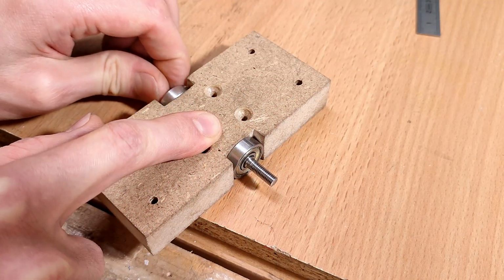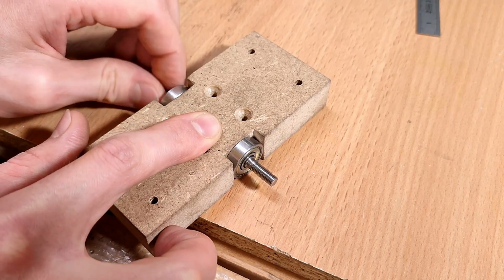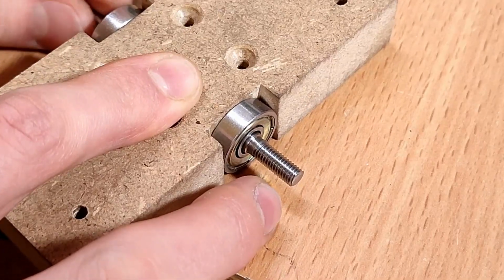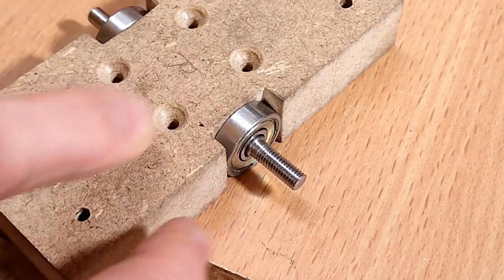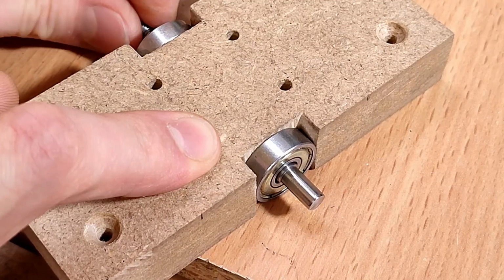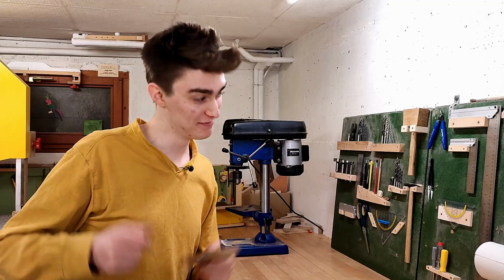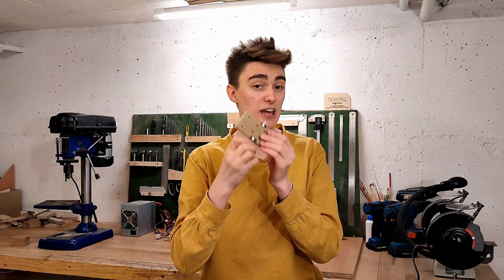Well, that's not promising. I just talked about runout being a bad thing on lead screws, and yet there's a dangerous amount of wobble on that threaded portion. It's even worse on that little pin that the pulley gets attached to. Seems like the hole in these bearings isn't even centered. Nice. Anyway, disregarding all the red flags, now I need some pulleys to put on those wobbly arbors.